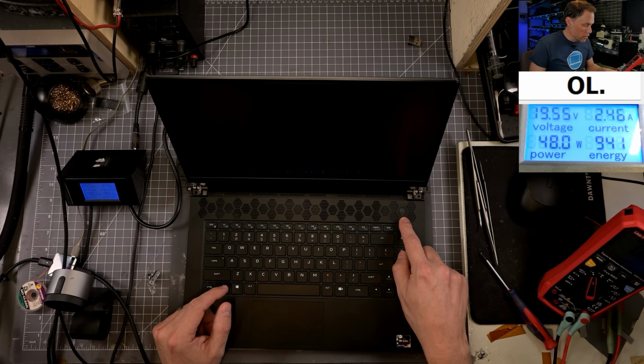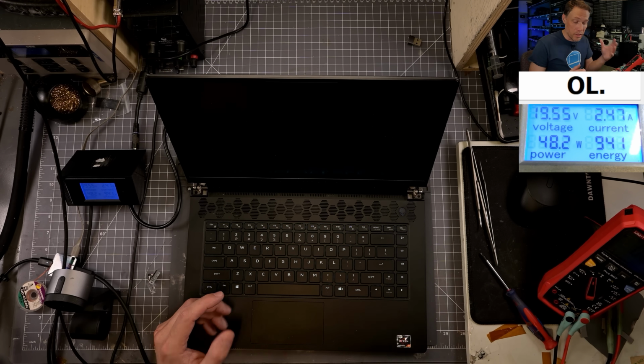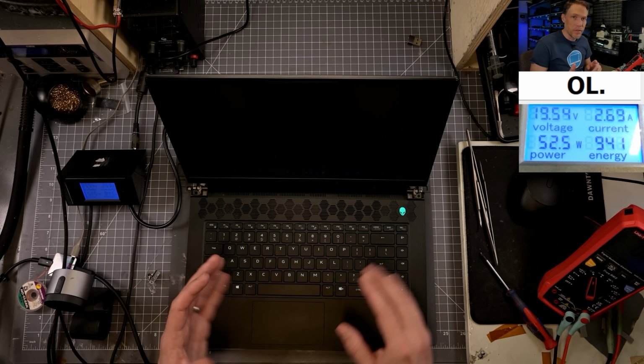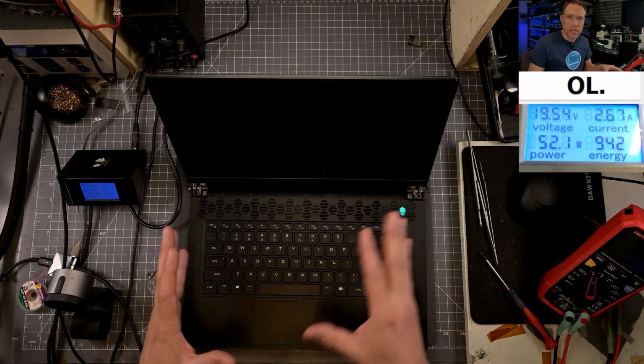We got 2 red, and then 7 blue, which is a 2.7, a bad LCD screen or bad LCD connected screen. So definitely that connector is messed up. We physically can see it's messed up. The screen's not showing any signs of life. I'm gonna go ahead and grab a test machine. We'll plug in a test screen real quick just to rule that out, and then we'll replace that LCD connector.